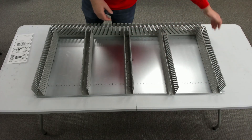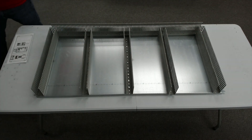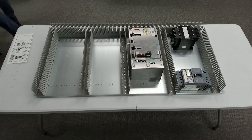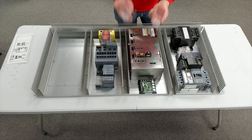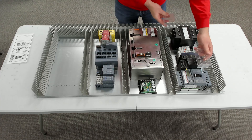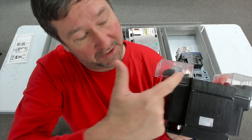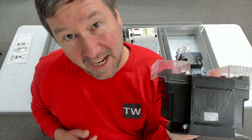I don't have a dimension drawing for this, but let's go ahead and lay it out and make sure everything looks good. Just like on this transformer, I decided I need a little bit more clearance. Also, when you are making sure that your spacing works, don't forget to install the covers on things such as your transformers and your breakers. Here's a really good example: without the cover it ends here, but with the cover on, that extends the mounting out this much — and I did not account for this when I was doing my panel layout.